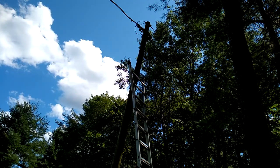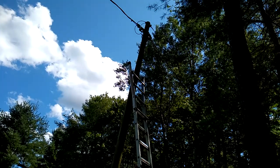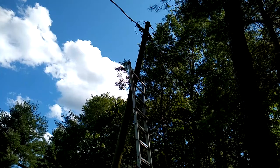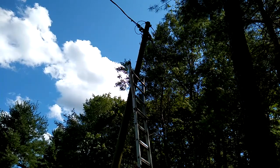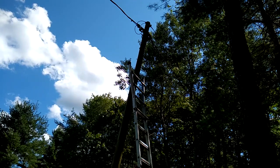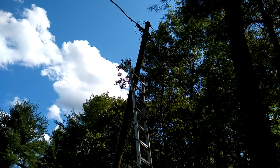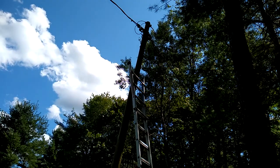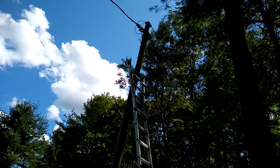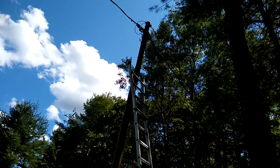I'm going to be changing out the power distribution box down here below with a little bit more modern setup. This had screw-in fuses. Mine's going to have circuit breakers. And it's going to run basically an underground line to my jet pump down below, down the hill. And it's going to be in a trench going over to a 30 amp hookup for my RV eventually.